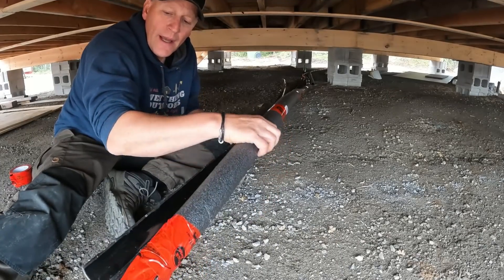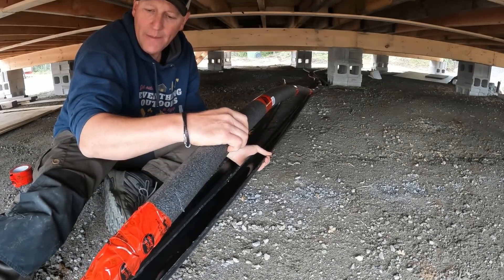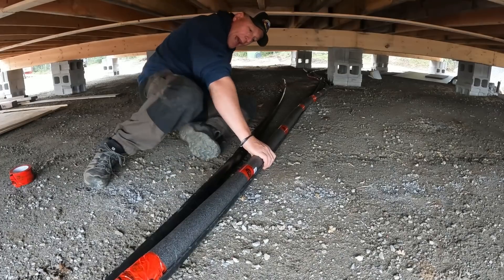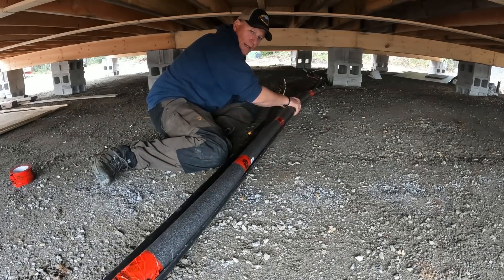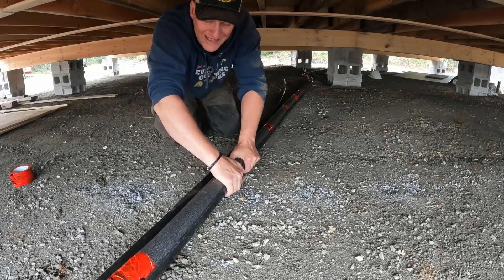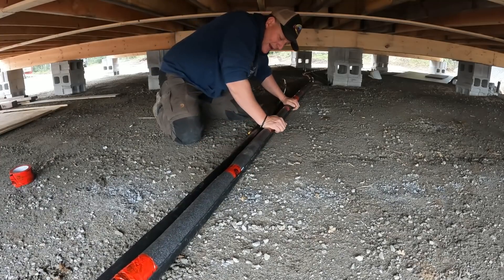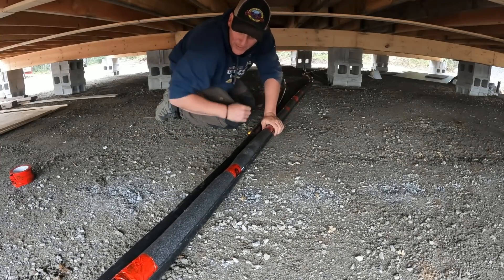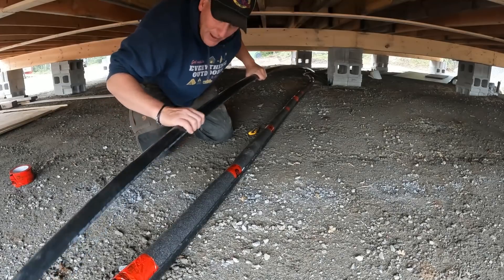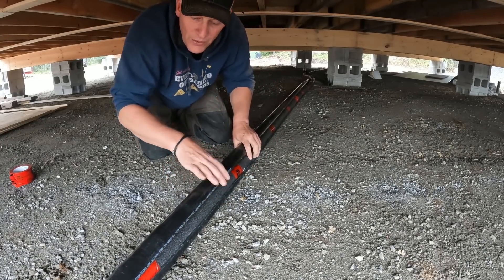Now I had to split this ABS pipe in half because it was too small for me to actually get the foam insulation and everything through - it just wouldn't slide through. So I split it in half and now I intend to rejoin it and tape it all the way around. Part of the reason why I'm using this ABS pipe is for support, because I cannot have any bends. As I've mentioned a couple times, in this water system you cannot have any water resting in a low spot. So I'm going to put this ABS pipe around it, insulate it, and then secure it to the bottom of my cabin on a constant grade - and it'll hopefully keep my pipe straight with no low spots.